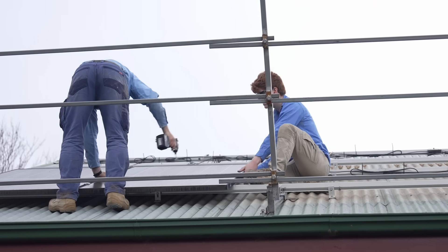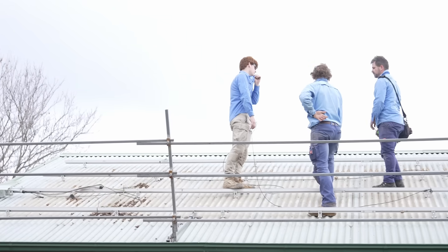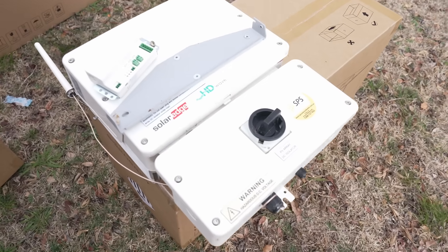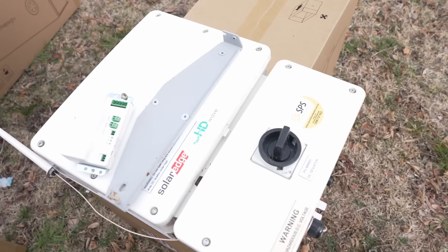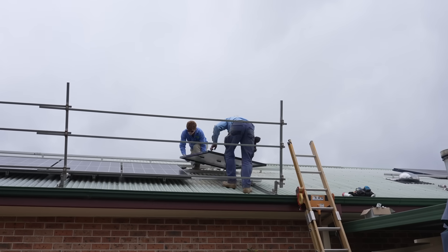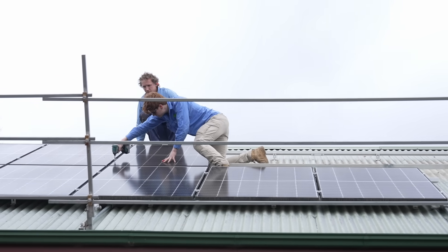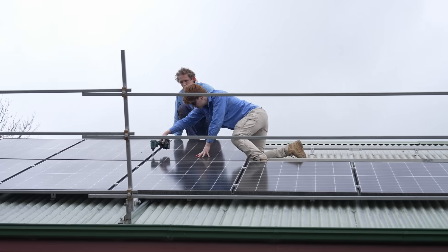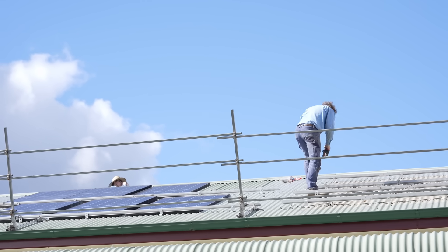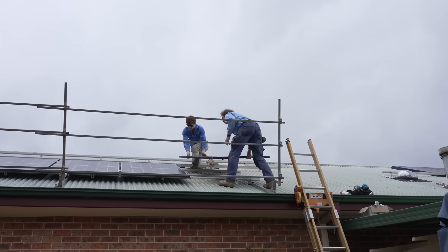Something quite unique that most people probably wouldn't have done - and some people give me a bit of flack for doing it - but I decided to use my existing solar system and then restring it to DC couple it to the battery. What I wanted was to have the ability to fully utilize the SIGEN store's efficiency of DC coupling versus AC coupled solar, as well as, probably the most important part, the ability to black start it. So if there were days with no grid connection, DC coupling allows it to really charge from nothing all the way to full and back down again, where AC coupled doesn't do that. I wasn't actually aware of that, but thanks to Sim for letting me know.